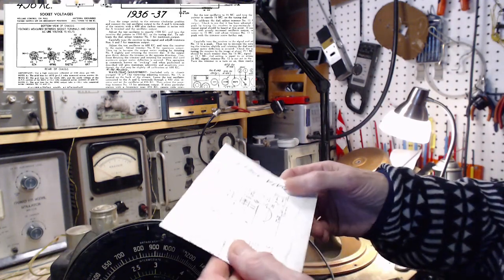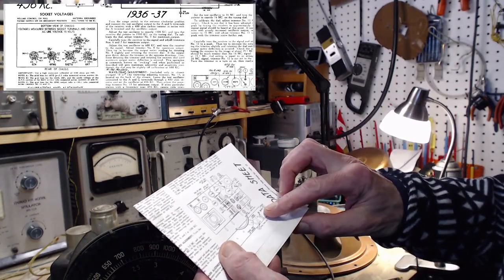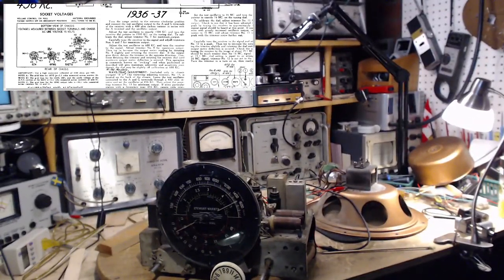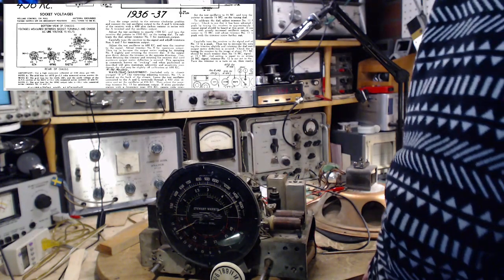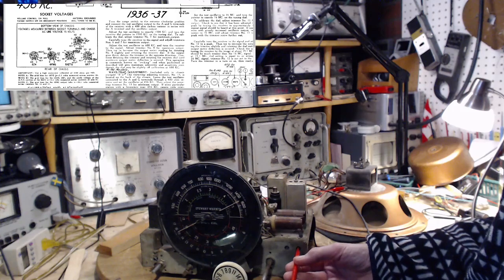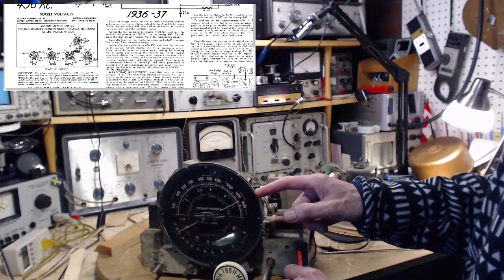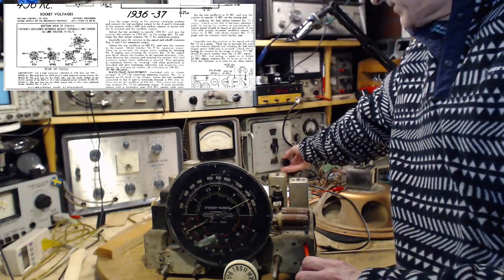1543. Our first adjustment will be adjusting the local oscillator for this band. I think they said number 5. 1500 kilocycles. Number 5 is right in this hole here. Okay. Do it with this guy. Okay, we're in. Now the objective is to get the radio to receive 1500 here, not 1540. So we'll turn this towards 1500.